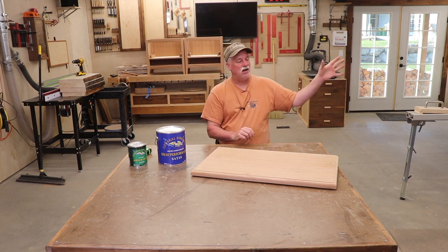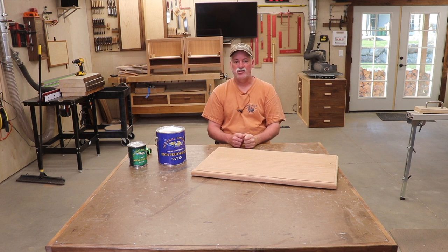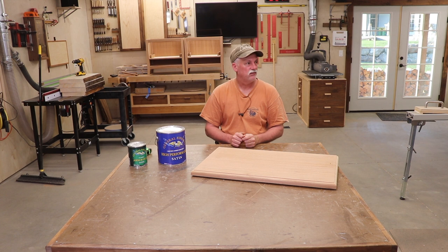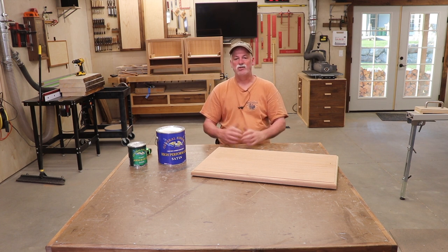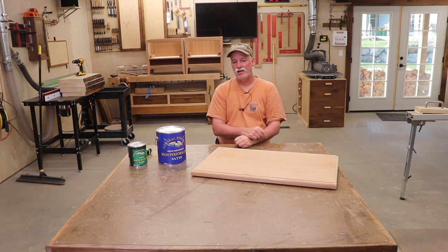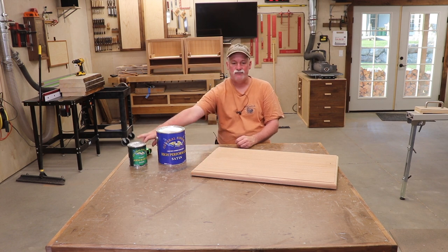But for tonight, I'm going to spend the night getting the shop clean. I'm going to clean all my filters. I'm going to let the air cleaner run all night and try to get the dust out of this shop as best I can, because that's best for the finishing process. I will see you guys in the morning when we start prepping these to apply the first coat of Armor Seal.